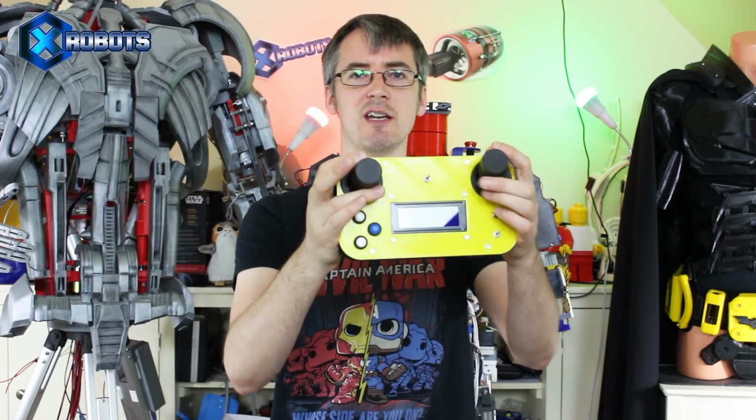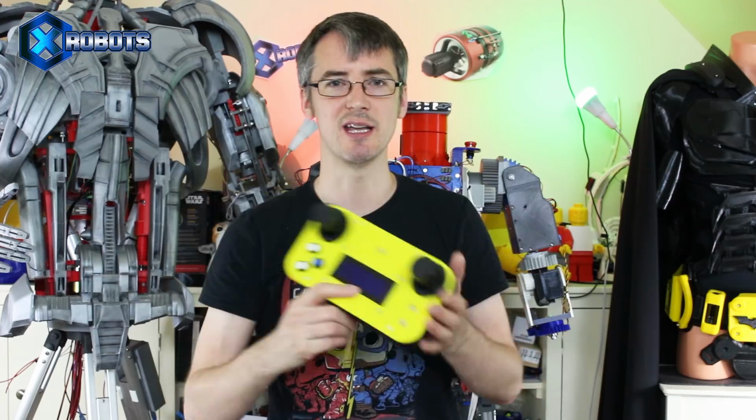So for now, I've actually published that dog model. You can find it in the link in the description below. It's on GitHub. I've published a solid model, which is a step file, and that means you can load it into any CAD and you can actually modify it very easily, unlike an STL. I've published the Arduino code for the remote and for the dog itself I've got so far, just that little bit of inverse kinematic model with the trigonometry, and also for the remote here if you wanted to build one. And these joysticks I got off eBay, they're about £10 each and they're pretty common items to find. Obviously it's an I2C LCD using the I2C LCD library and an Arduino and the HC-05 Bluetooth modules which make a transparent serial link.